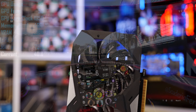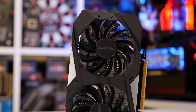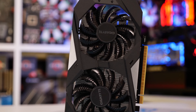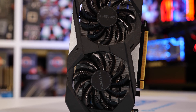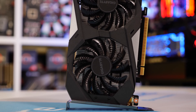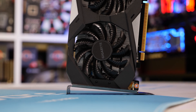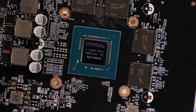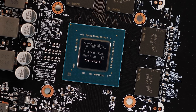Because the base model is limited to the 75-watt power delivery of the PCIe x16 slot, it can't clock higher as it would be running out of spec and could risk damage to the motherboard. Out of the box, we saw a peak GPU load of 67 watts, whereas the Gaming OC model hits 72 watts. Overclocking the base model isn't really possible — the card's power limit is locked to 100%, and at most I was only able to squeeze another 15 MHz out of the cores, pushing GPU load to 69 watts.